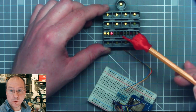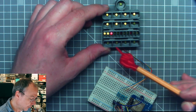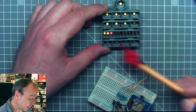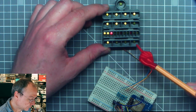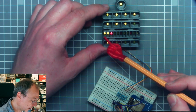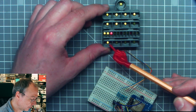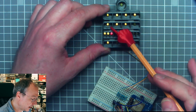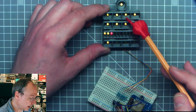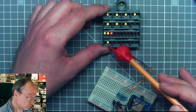And how this clock works is that we have minutes. So each of the LEDs down here is 1 minute. We can have 1 to 0 as it is now. Now we have 1 up to 4. Then we have LEDs which are worth 5 minutes each. So this is now 16 past. We have 5, 10, 15 plus 1 is 16 past. And then we have single digit hours, so 3. And then we have 5 hours here, which means that it's actually 23 hours, 16 minutes.